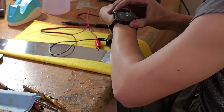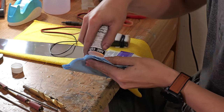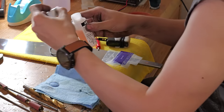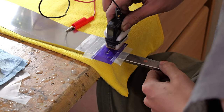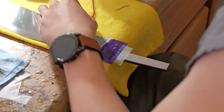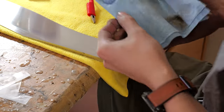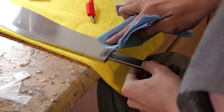As I've used this etching machine more and more to etch my maker's mark, I've developed better and better formulas. The one you see me using here is 2 out of 5 power for 1 minute and 30 seconds. I found that it comes out pretty well, very, very deep, and not too much washout.